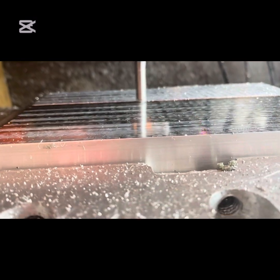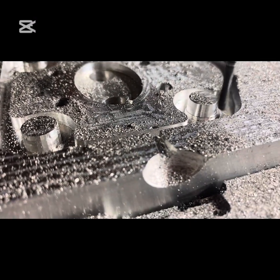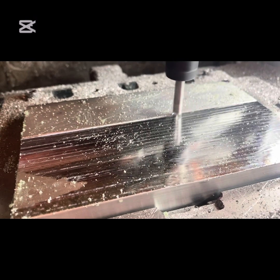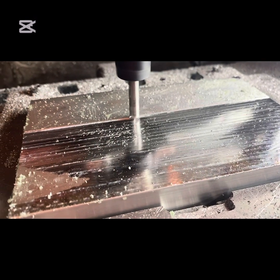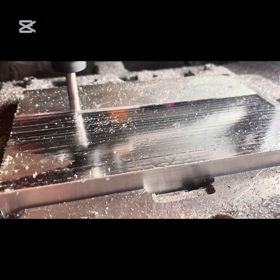I also use a lubricant on the materials. I brush on a little bit of All-Cut, which is a kind of wax-type material that helps the bit cut better. But it sure does a nice job — look at that facing operation. I want to say thank you to SainSmart for all their help and providing such good material to work with.